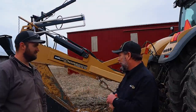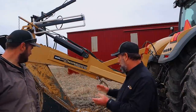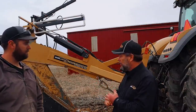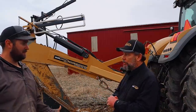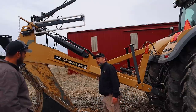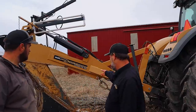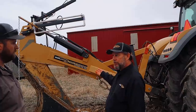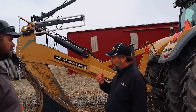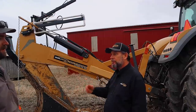It's done just fine. I know we had a tow rope on it for a couple of the mains, but we're also going four feet deep. Every one of our plows has got a second tow point already hooked to it, so you don't have to pull on your tractor. The pull type has it in a slightly different place, but the three-points both have a place you can put a clevis — you pull the second tractor right onto the plow, and that's the safest way to do it. I don't think you ever had to have a helper tractor on any of the laterals.